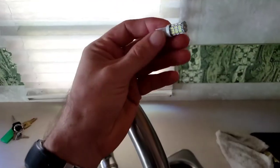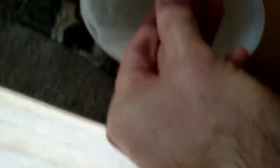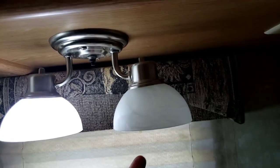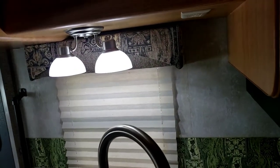Here are the LEDs — they're like 192s, 194s. They are sensitive to positive/negative polarity. So if you put them in backwards you have to rotate it so positive side to positive, negative to negative. It's kind of common with some of the cheaper LEDs.